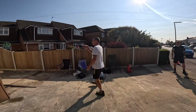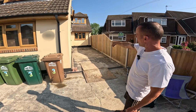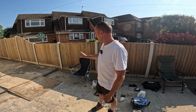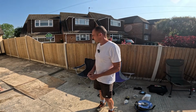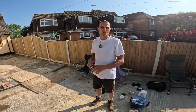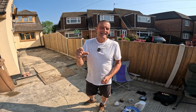The lady wants us to change a slab on her step because it's broken. We're going to put some little cobbles around that down part there because it's getting full up with grit and dirt. So we're going to seal that up for her. I've got to cut a bit of drainage for that bit there. And then again, you put some lines up there, and I can have a good measure up to find out how much base we've got to put in, or 10 mil, or whatever we're going to use. 30 mil topping, 6 mil SMA.